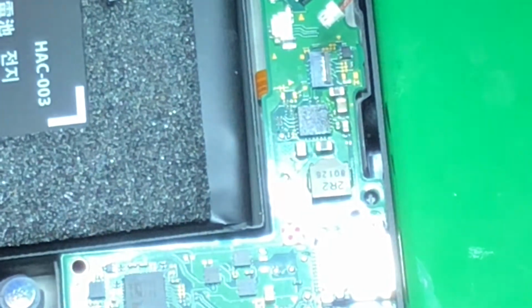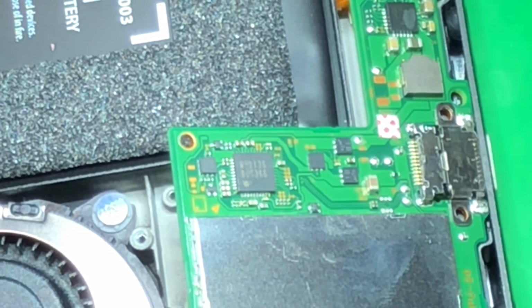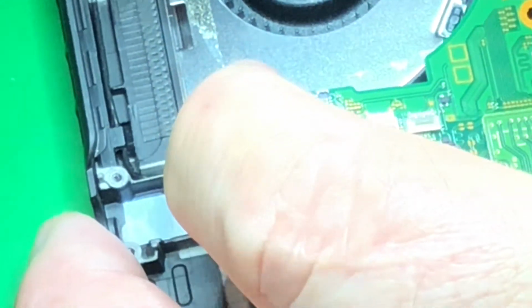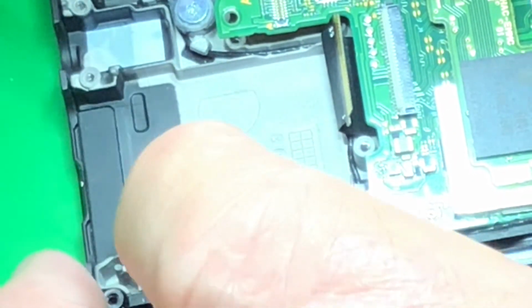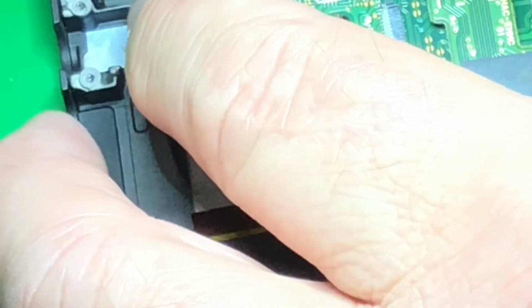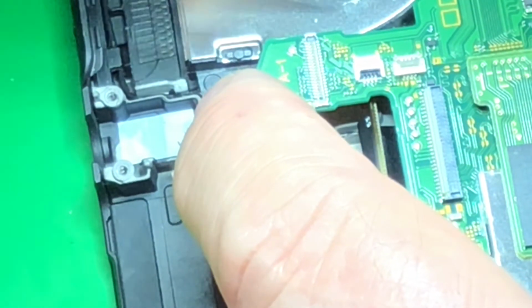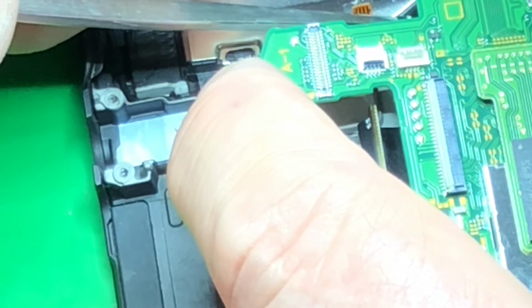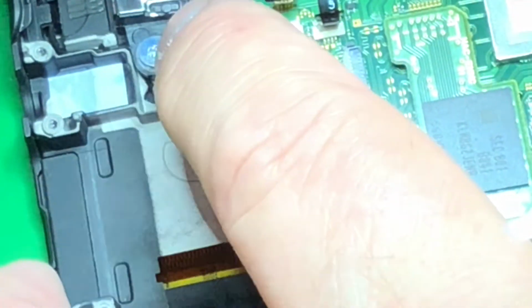But don't get in the mindset of turning your gun up to its highest temperature so that you can get it hotter faster. That doesn't work. If you do, sure, you'll get things hot, and when you hit the chip, it'll liquefy quick, but then it'll quickly race past your desired setting, and then you're going to be in break-stuff land so fast your head will spin, and you're going to run into problems, and your flux will burn. Just do what I do. Find the temperature that works for what you're working on, and then don't go crazy.